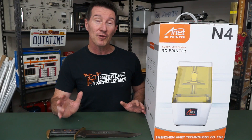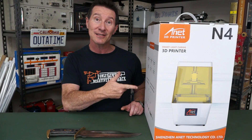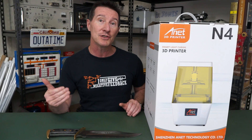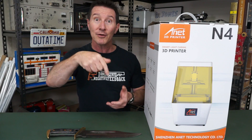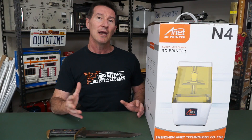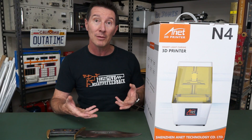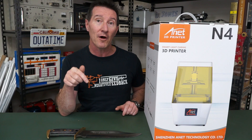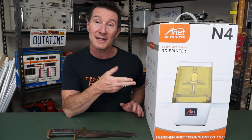Just a brief overview of 3D printing technology. There are two major types, at least in this category: FDM or SLA. This is an SLA type, but you're probably more familiar with FDM — fused deposition modeling — where you get ABS or some other material and squeeze it through a nozzle, draw out your pattern, and slowly build it up layer by layer. This is an SLA, which is a stereolithography technique — also known as a resin printer — because it uses a resin material that's liquid, and when you apply ultraviolet light to it, it hardens up. These resin printers are available in three different types: LCD, DLP, and laser.